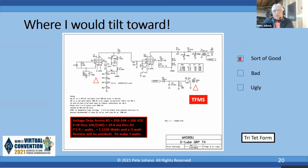In the prior circuit, if the guy had just clipped that lead and grounded the rotor, you'd do the same thing that Nick has done here. So across that tank, L2, you essentially have C2. That's why I bring that up, you need to look at that, because clipping that lead sure makes it easy. You don't have to do all the physical isolation and worry about DC voltage on the rotor.